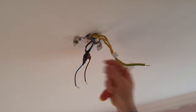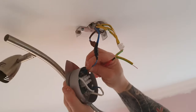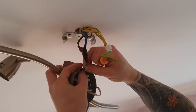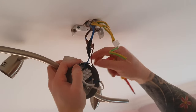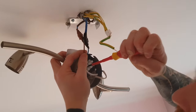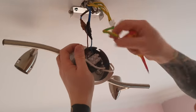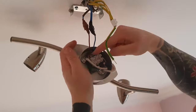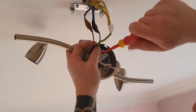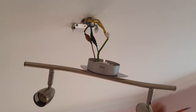Because we've extended the wires down, it gives us a lot more room to actually wire the light up. We're going to put the blue neutral wire into the neutral terminal inside the light fitting — it can be a little bit fiddly, and these connectors can sometimes come out if you want to remove them. Give them a tug once you're done to make sure they're properly in place. Obviously brown live goes into the live terminal, and earth into earth.